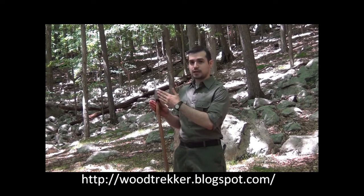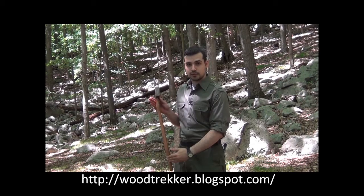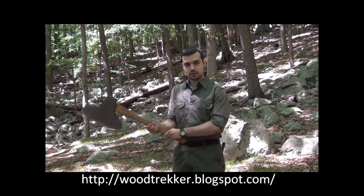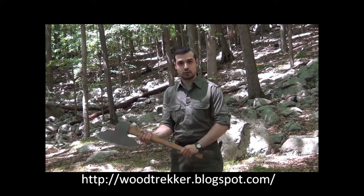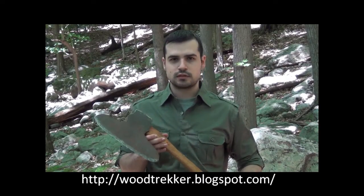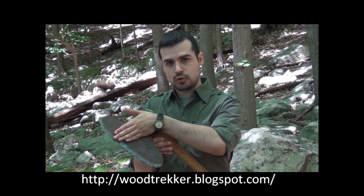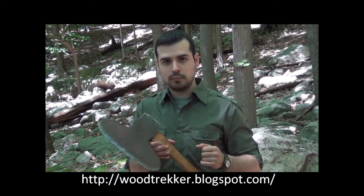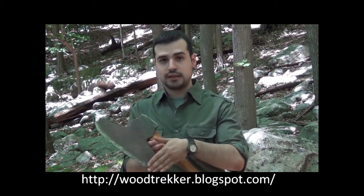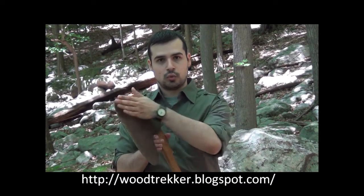Another feature is that most of these axes have an offset handle. The one you see here has a dog leg offset as opposed to an S-shaped offset handle. This is done so that the knuckles of your hands are away from the wood that you are hewing, to protect them from impact and from scraping. Another important feature of the broad axe is the design of the head itself. Typically on a broad axe the side of the head which faces the wood is entirely flat all the way from the pole to the bit. The good ones have a slight taper from the heel to the toe, but it's very hard to notice with the naked eye. The beveling is done on the side of the head away from the wood, creating a nice chisel edge with a flat side which allows you to get a nice smooth surface from the log which you're hewing.